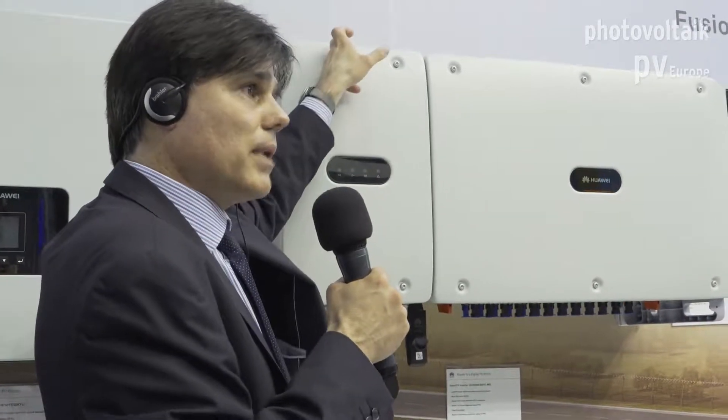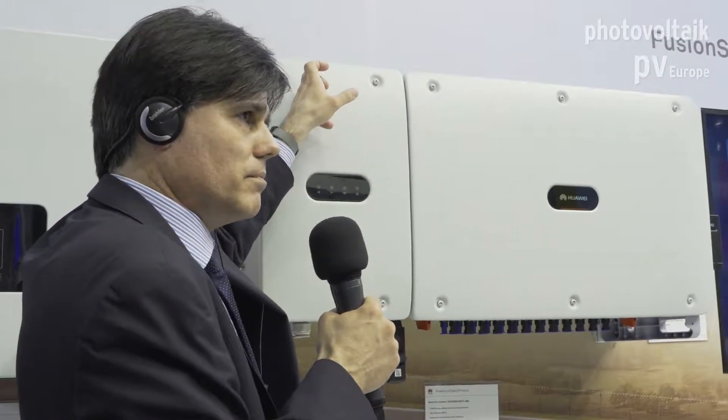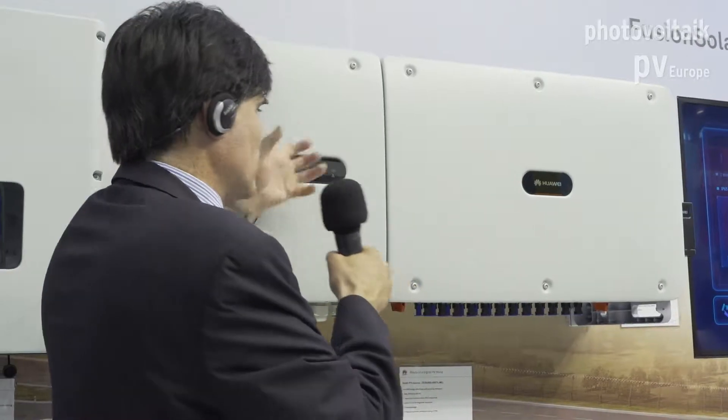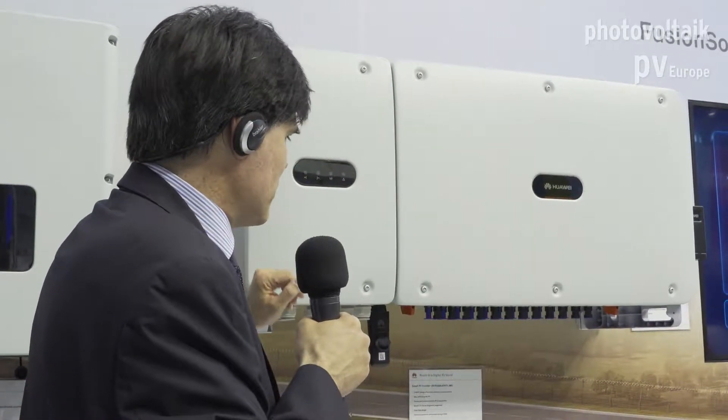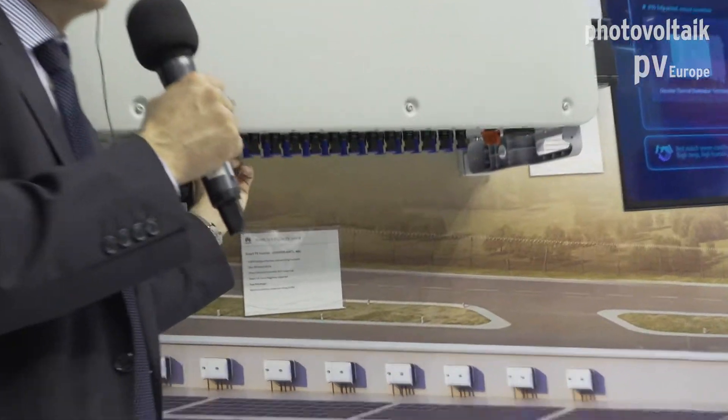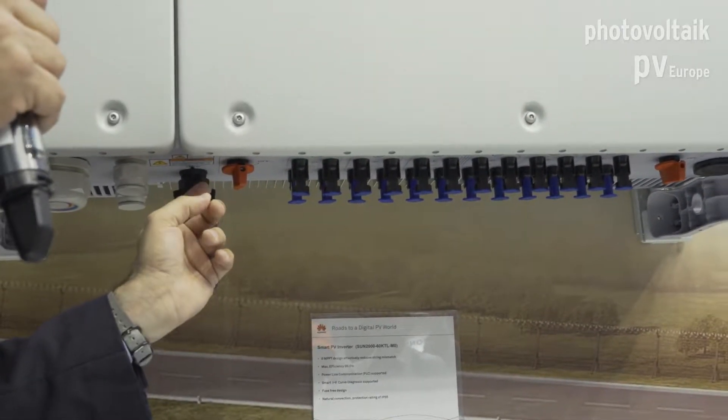It's a simple change, but many installers don't like scratching their hands trying to fit cables into connectors at the bottom at the wrong angle. You'll appreciate the device if you can comfortably put everything in place. The DC side shows all string connectors at the bottom, and another highlight is the hand-operated DC switches — two of them. This means during maintenance on modules, you only disconnect half the inverter, while the remaining 50% continues working. That was a quick overview — any questions?